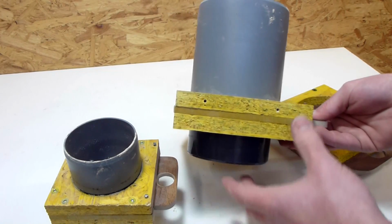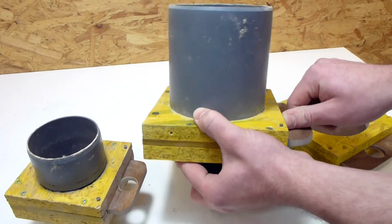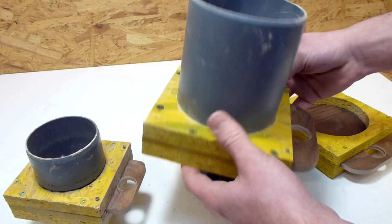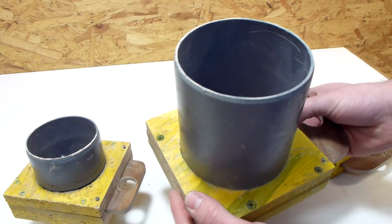What you can also see is that they have this clog-free design where the slider goes all the way through, so sawdust can't jam up the slider. Many people who make homemade blast gates like this have problems with the slider jamming and you can't get it shut or opened, but I don't have this problem at all.